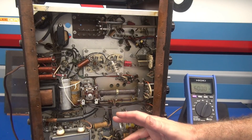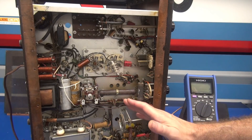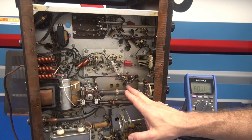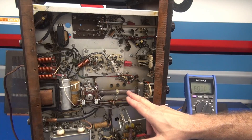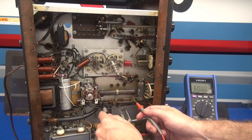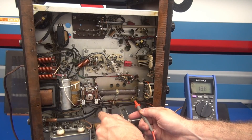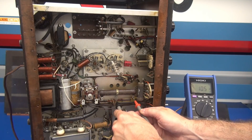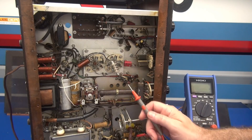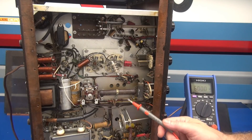If you see those old caps, they've got to come out — put in fresh caps before you apply power. You're going to do it either way, so why not do it at the get-go. The first thing I need to do is check this modulation resistor. This is how you set the bias to the 807s — it's a 20k resistor and they're very common to have failed. I'm reading 18.8k, and at the center tap I get 10k, so about 8k on the other side. It's good — thank God, because that's about a $30 resistor after buying and shipping.